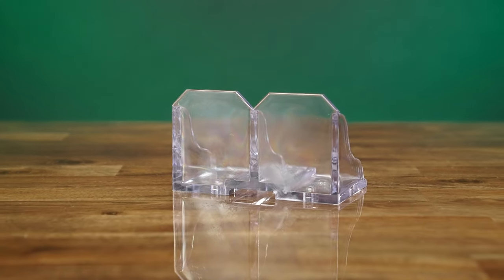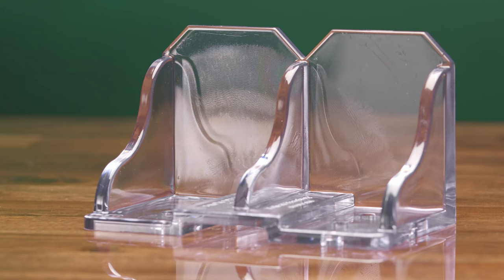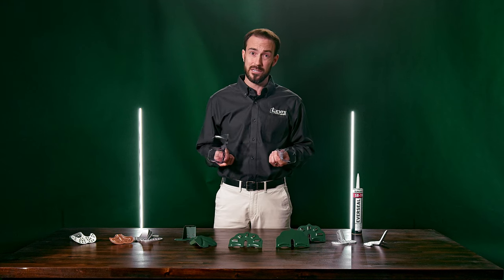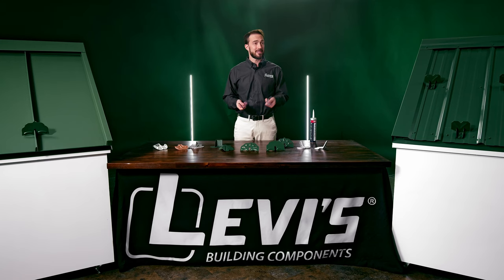But even with fasteners, polycarbonate may become brittle over time and break down. So even though polycarbonate snow guards may cost less individually, the cost of the adhesive and the fact that they require more units to reach the needed holding strength makes the system more expensive than some mechanically fastened snow retention systems.